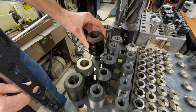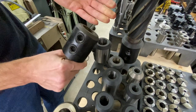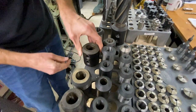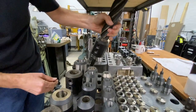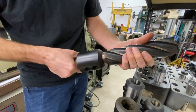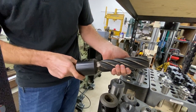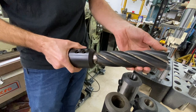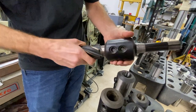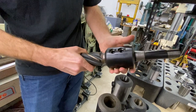You can get up into large diameters — three-quarter, one inch — but one-and-a-quarter holders are not really that useful. They're just too big of a tool to be very effective in an R8 spindle machine; it's just too much load. There are some tools I would consider not very useful, though we almost didn't keep this one. We found it's a good idea to keep unusual things you come across. For example, this one is very good for plastics and wood, or a deep cut that would be very difficult on the mill in a big piece of plastic or wood. The machine can cut that with this tool with no problem, and there's not enough load to cause issues with spindle overloading or torque.